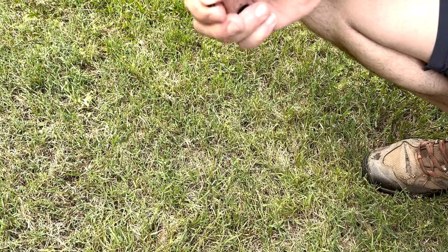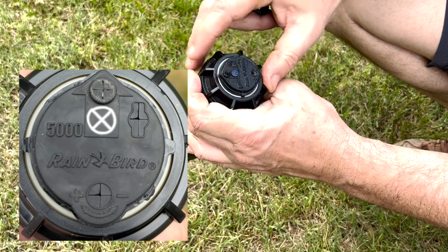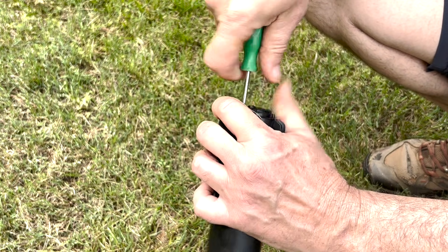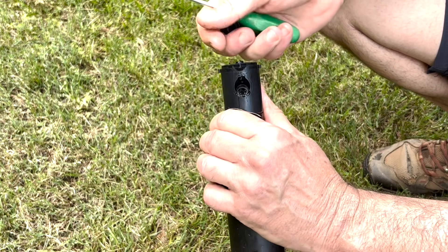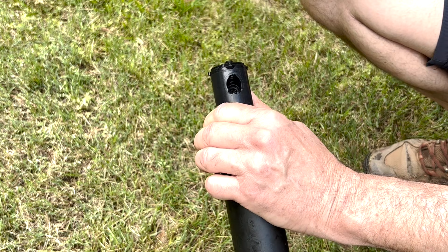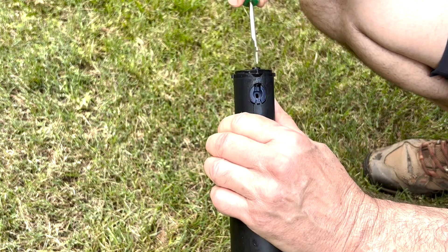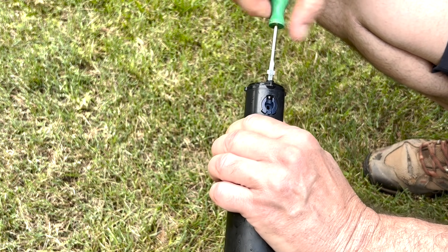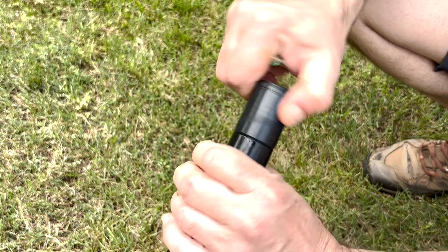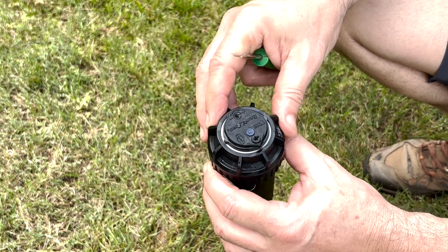We're going to pull the nozzle off and the little tab, then go ahead and put our tab in there so we'll know exactly what's going on. Turn it 90 degrees, pull it up enough to grab it. There are tools you can get that'll hold this shaft up if you don't have enough hand strength — it does have a little bit of strength to that spring. We're just going to run our screw back in enough to hold the nozzle in. I always like to turn it to the left limit, then turn it back on and make our adjustments from there.